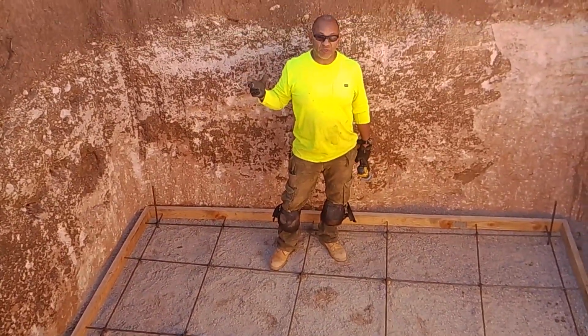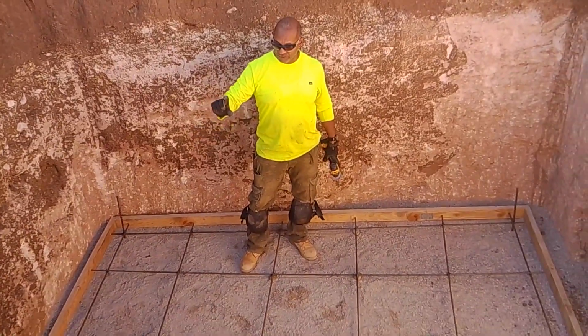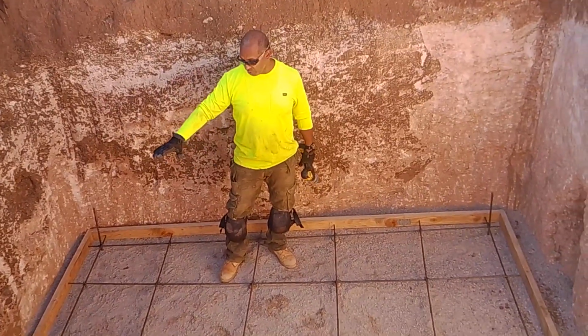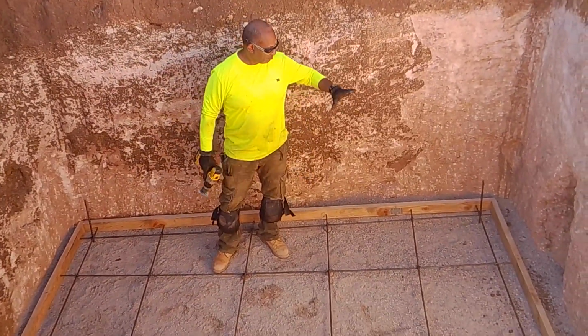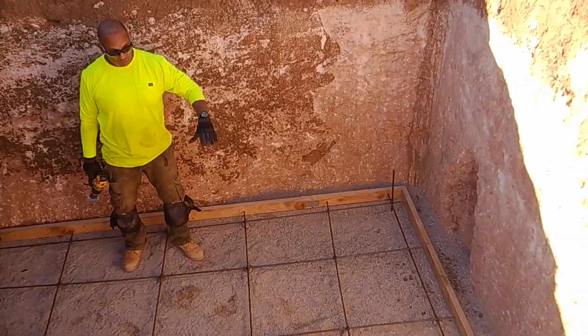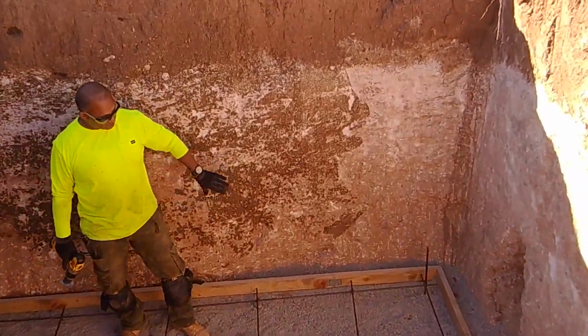If you get it from a lumber mill, it's really 2x4s. I learned that. But anyway, the width of the board is going to be the depth of the cement. So you get your board level, and then you put your rock and your gravel and sand up under it to make sure it doesn't move. You get it stabilized. We backfilled it so that the weight of the cement can't move the square framing.